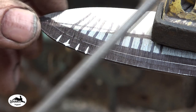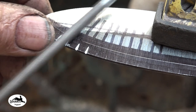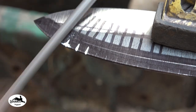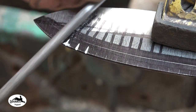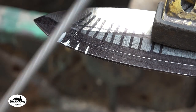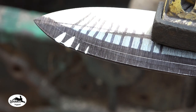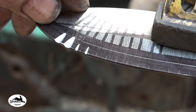I'll just do these three because the camera's in the way. Now I can feel that groove in the file, so I'm going to start filing it on that original line there and I'm going to go to that scratch line, then I'm just going to check the front to make sure it's on the line — and it's absolutely just on the center line there now. It doesn't matter if you go past it a little bit. Do the second one. Try and get them all the same if I can. This one wants to go a little bit deeper at the front towards the center line. That's correct.